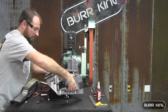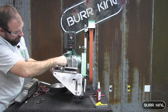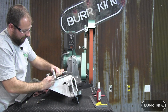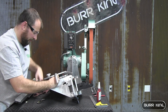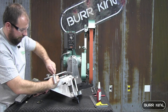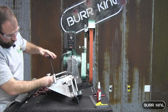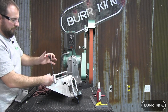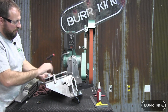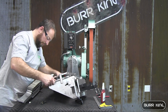Once we get the hand wheel in, we're going to pivot this around and install the handle for the X-axis. To do so, slip the handle in and slide it in place onto the pin. There's a spacer — slide the spacer in place — and then there's a shoulder bolt with a washer. Snug that up so it can still freely pivot your X-axis.